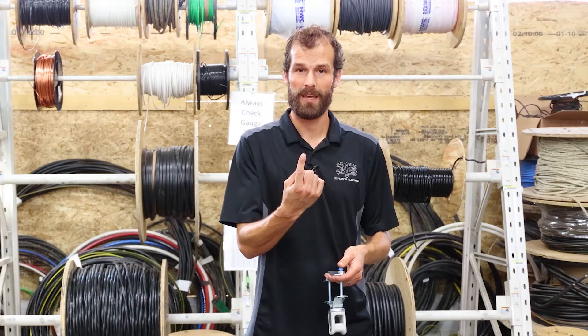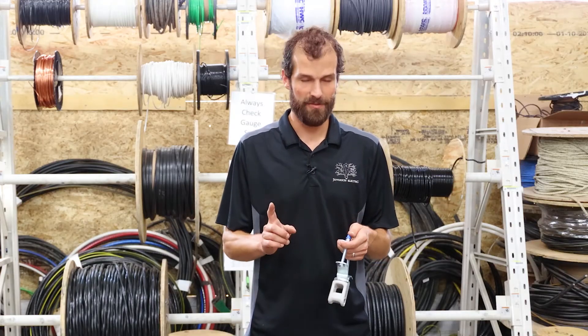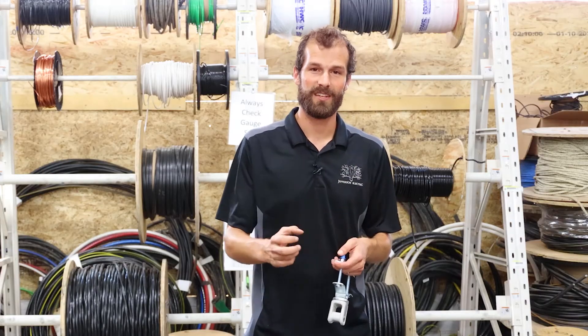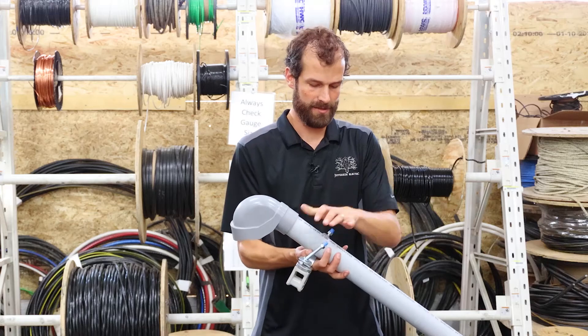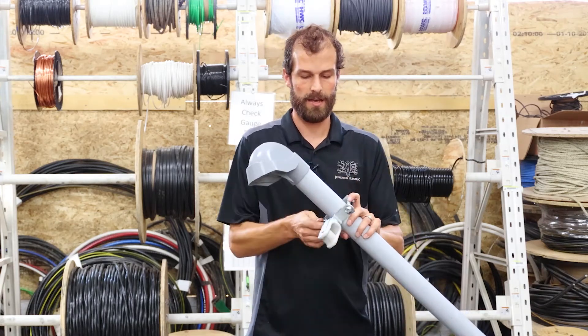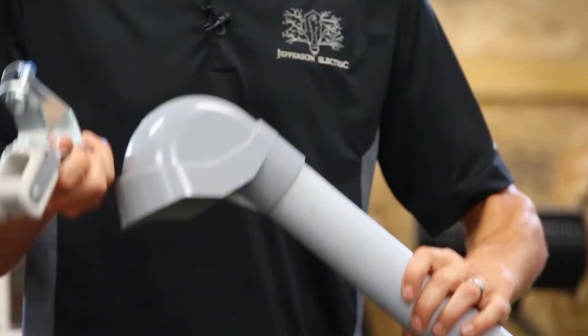The second style is this clamp-on P-knob, also porcelain and insulated, designed to be secured to a mast or service riser that meets utility standards to become the point of attachment. Those service risers typically penetrate through the soffit or roof, are secured by fittings and the home's structure, and often require an additional tie-back from the mast to the roof for rigidity. PVC is not a suitable mast when it's the point of connection — it would need to be IMC or rigid conduit.